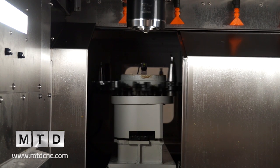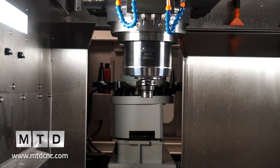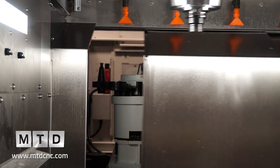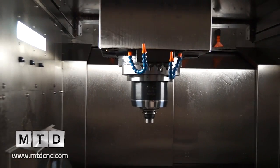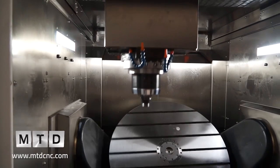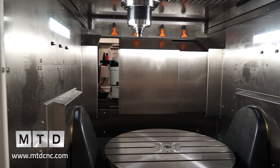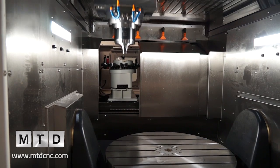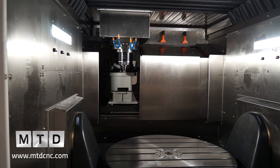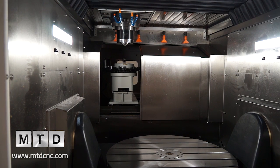The spindle on this machine is a direct drive spindle. Equally, the A and C-axis table is also driven by direct drive motors. So that, combined with the casting of the machine — the base and the sides — the direct drive spindle and the direct drives on the 5-axis table all go together to give you possibly one of the most rigid 5-axis solutions you can find in the modern market today.